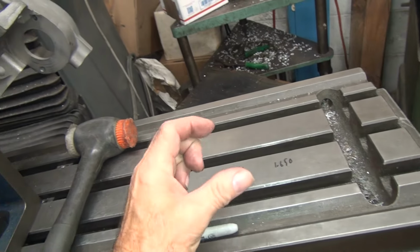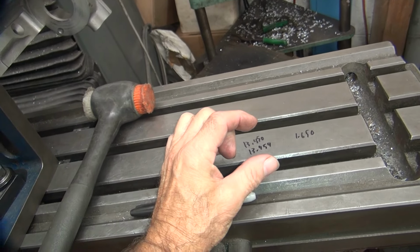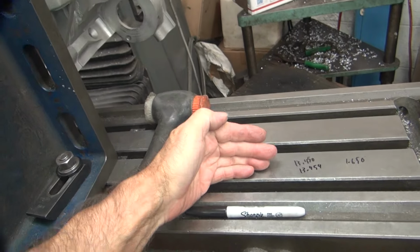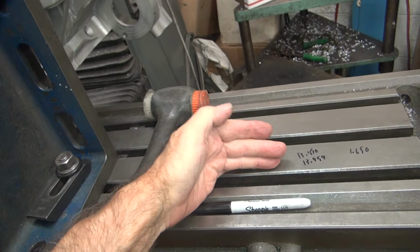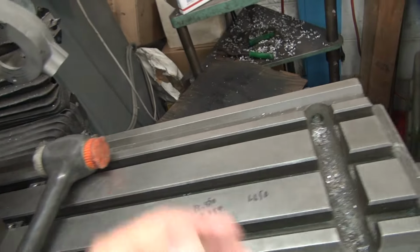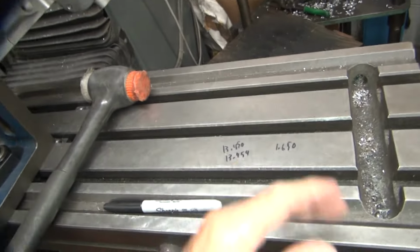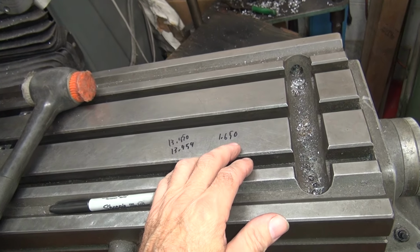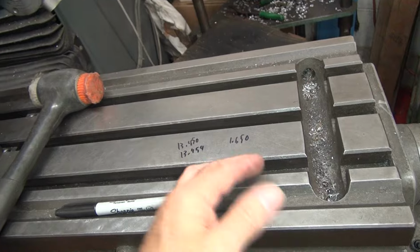Now, how much of a space are you supposed to have underneath your mount between a panhead frame and a knuckle frame? Some people say 3/8 of an inch. Some people say 300 thousandths. Some say 1/4 inch. V-twin, I think they were running about 300, as I recall. About 5/16 roughly in their frames. I think is what I read someplace.